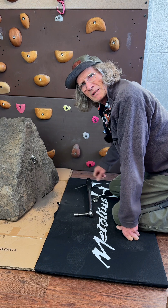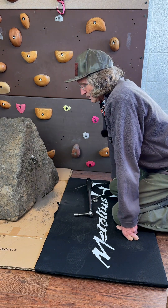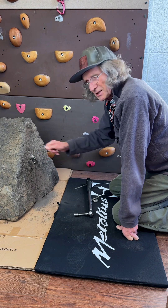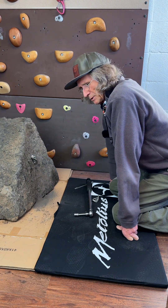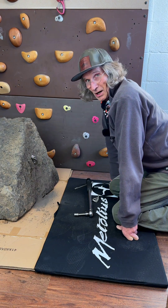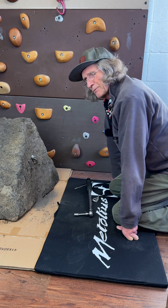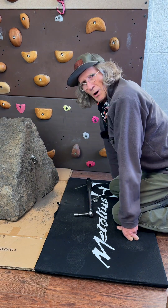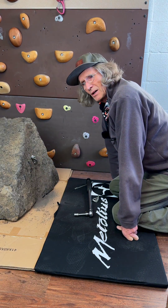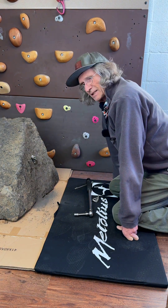It's a sort of a creeping thing that happens with almost all stone. So you'll tighten it to the right spec right now, but then you'll come back a day or two later and find that it's loosened off. So this is all we're going to do for now and then we'll come back tomorrow or the next day — some time after 24 hours — and tighten it again.